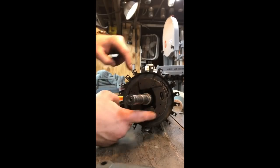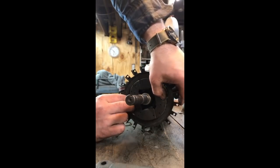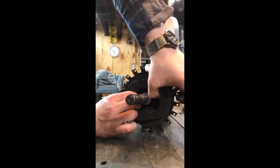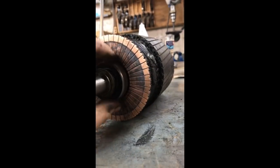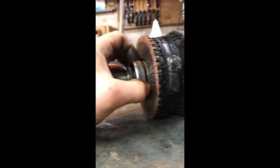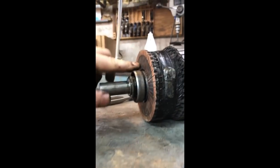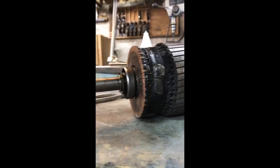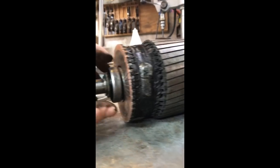This thing looks like it's solid but it's got these joints here and I'm like, what the hell is that? So I start pulling on it — oh my god, it does stuff. Okay, here's what we have: this is the rotor of the motor. This motor is a repulsion-start induction-run motor, so it starts out as a brushed motor. There's the commutator for the brushes, and there is the main rotor portion for the windings.